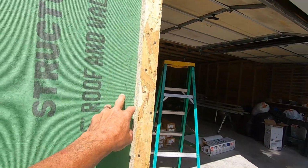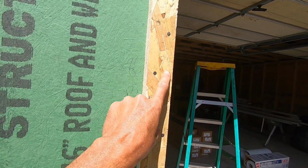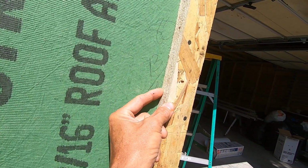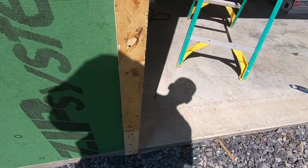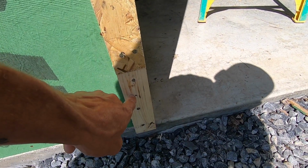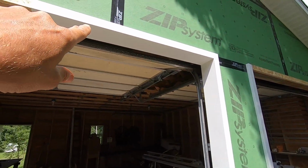For today, I've been working on capping the outside of these garage door framings with aluminum. I used some stuff my brother had laying at a job site that he didn't really want. It's basically 1 1/4 inch scraps of rim joist, like OSB but 1 1/4 inches thick, about 2 1/4 inches wide this way. Down at the bottom, this type of material can wick up moisture and swell up pretty easily, so for about 6 or 8 inches down here I put a piece of treated wood. I already have 3 of the 4 sides on, and one of the top pieces on.